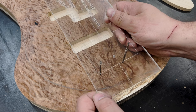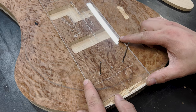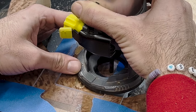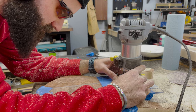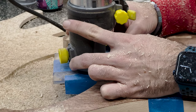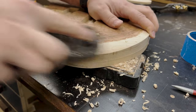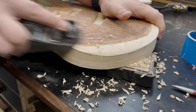More inappropriately used drill bits. We're lining up the neck pocket for routing, and they worked great in this situation. I honestly struggled a little bit with this. I haven't done a lot of routing, and the design of this thing didn't help me here at all. This hand plane did, though. This could be one of the most satisfying woodworking tools that exists. We like our wrists to be fully functioning, though, so when it came to contouring the body, we knew we had to use alternate methods.